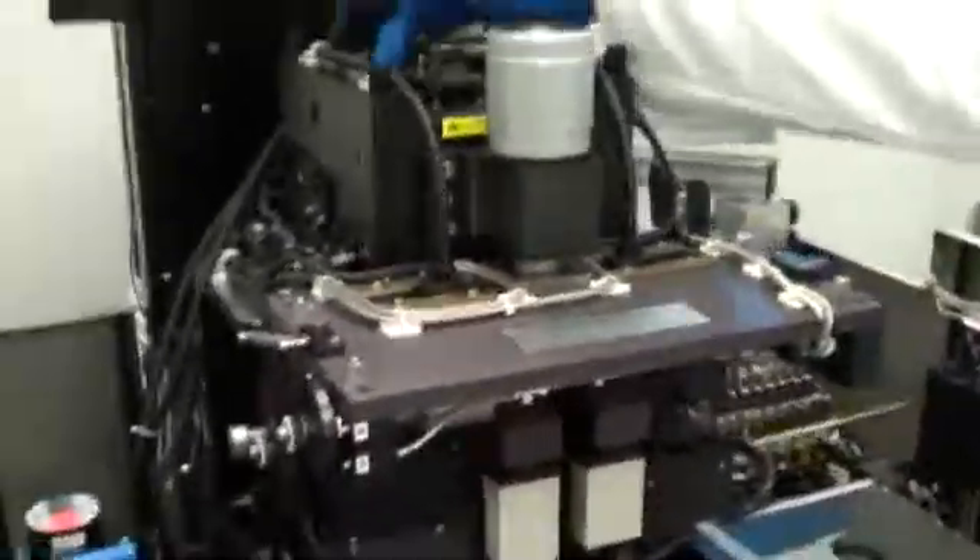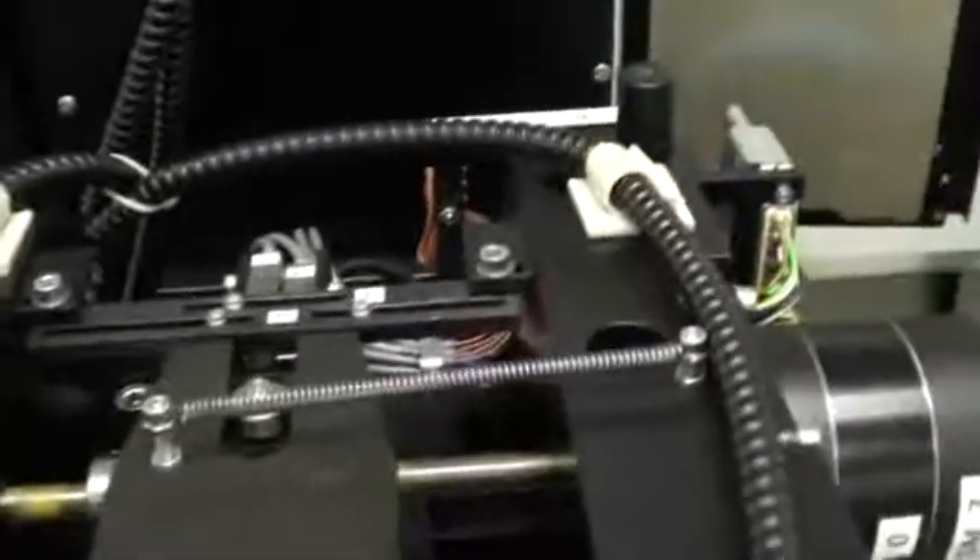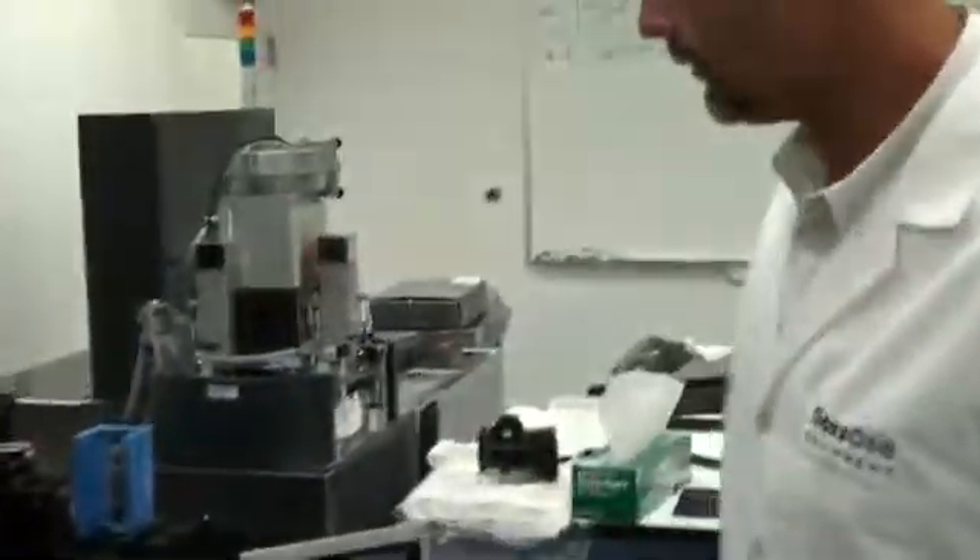Finally, the TSA manipulator, which was actually in immaculate condition when purchased. The grease is a little bit old, probably just from sitting. So all axes are going to be stripped clean, completely exercised, and re-lubricated with brand new grease. The actual dovetail bearings will be checked to make sure they're okay — and they look great. Looks real good so far. We'll continue this at the next stage. Thank you, Jude.